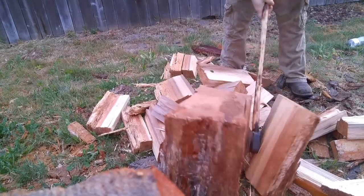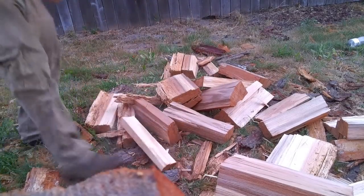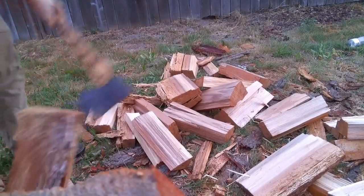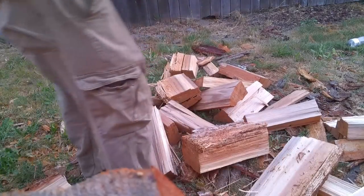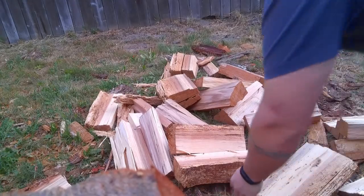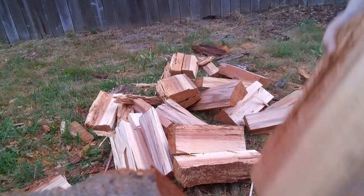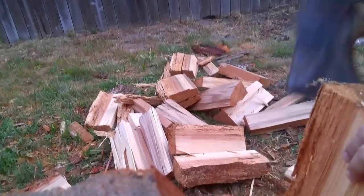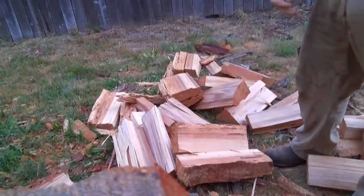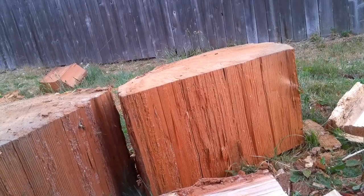This one's not too bad at all. As you can see, you get towards the butt on this log and, as is typical in Douglas fir, it gets really kind of stringy — you get a little twist to the grain. That one little quarter there has made quite a pile of wood. You can see the rot there on the outside. Now look — there's some of that pitch, just right in there, pretty thick. You touch that with your hands and you can get it off; it's not the end of the world. I've heard butter works well; I always just use rubbing alcohol.